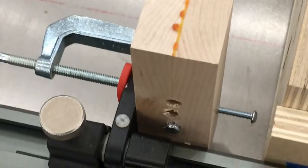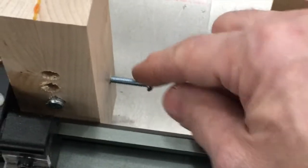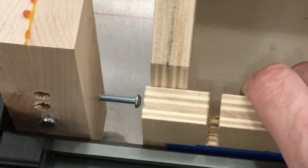Okay, so there it is — there's my micro-adjuster. You see it's got the macro-adjustment moving left-right on the crosscut sled. I've got a micro-adjustment here where I can take a screwdriver and move this screw in or out, and the jig will just butt up against it. I can just clamp it in place right here on the back.